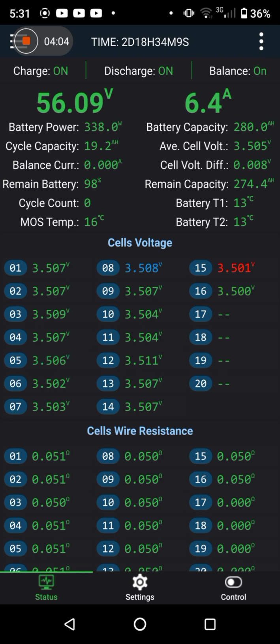So really there's 1.5 volts to go, 1.4 volts, 1.3 volts to go until I reach the float. So the current is already tapering off. It's not going to go steaming straight up to 3.6 volts with the maximum pressure, the maximum bulk charging voltage, stressing things out. It's going to work its way, absorbing gently up to my float voltage, which is quite good for idiot proofing.